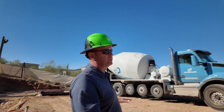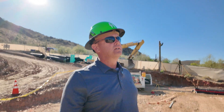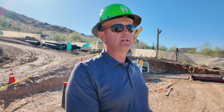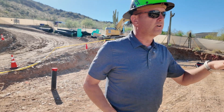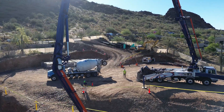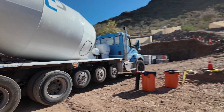We're doing this footing pour down below in one pour today. As soon as it's set tomorrow, they'll strip all the forms off the steps, and the block guys will move in and start setting block on the footing in a few days — a pretty quick turnaround. When we start pouring the grout in the walls, we'll pay attention to strength — we'll do core samples and make sure the breaks are good before we start backfilling. Once we start on these bottom walls, the concrete guys will come back and start digging footings up above for the upper retaining walls. We'll have different things going on in different parts of the site, and that coordination is key to keeping everybody moving and the job site progressing.